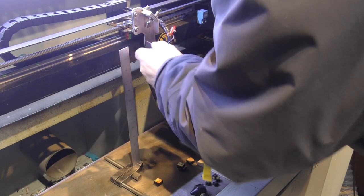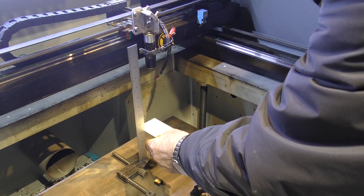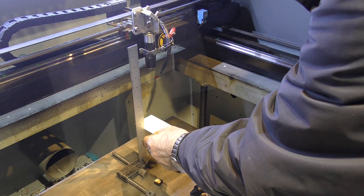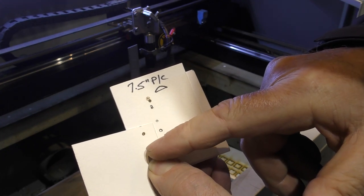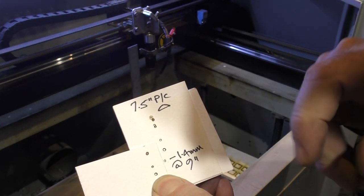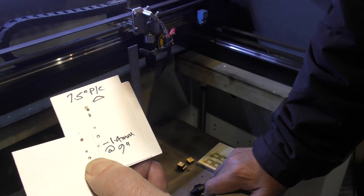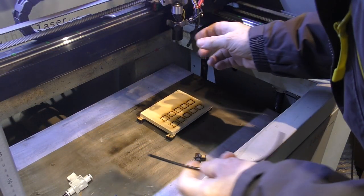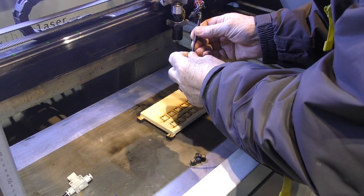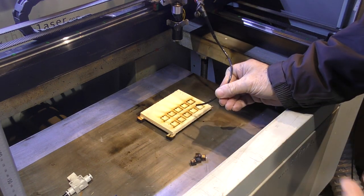Next, we're going to turn the lens over and start off at nine inches, since we know that's roughly where the focal point is. Comparing the two orientations, the hole in the middle is smaller flat side up, but there's a bigger halo. So having the lens flat side up might give us a narrower cut. At nine inches — nominally the correct focus — with no air assist, I'm going to put some air down onto the job with this little piece of pipe just to stop the flames.